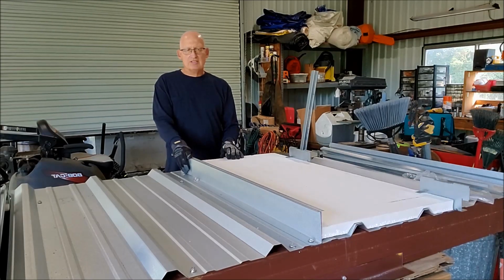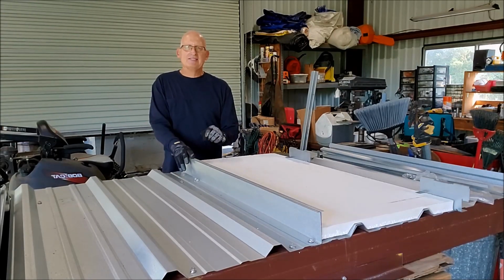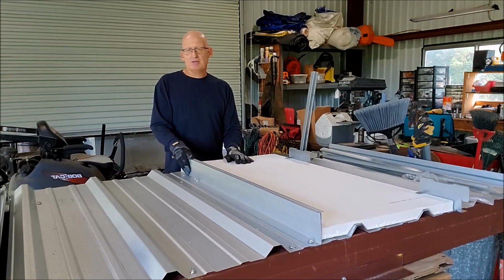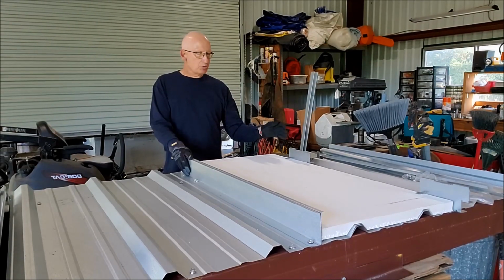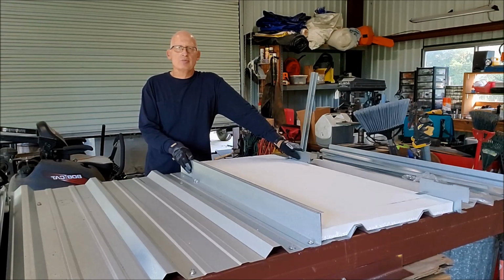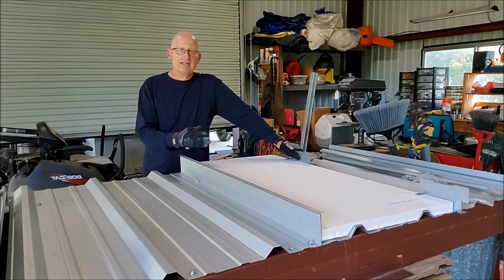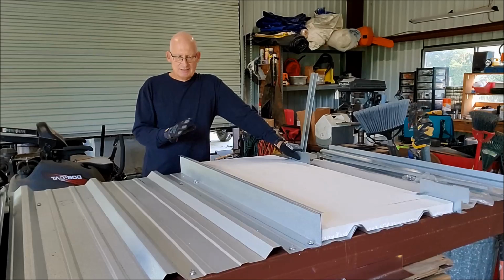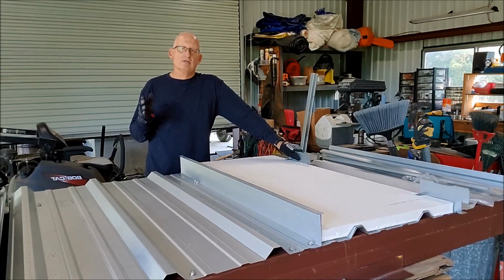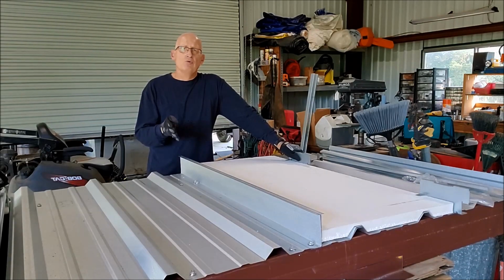This is something you're going to do up to a minus 91 pounds per square foot wind uplift at 5 foot on center. So that's the maximum. If you're in a really high wind zone where your corner pressures are over 91 pounds per square foot, then this is not the system for you. But this is the system for an owner who is tired of the leaks, wants to spend the least amount of money but get the very most for his money.